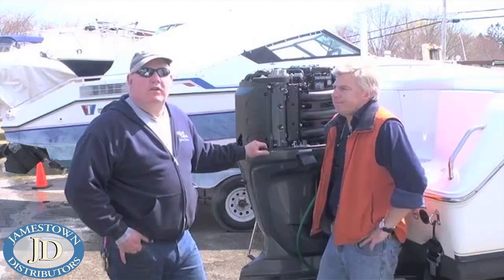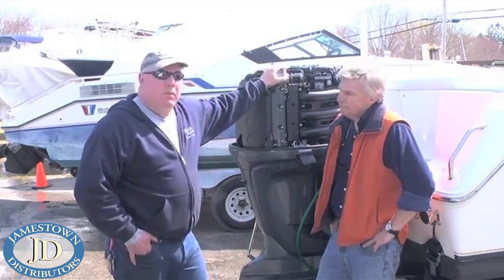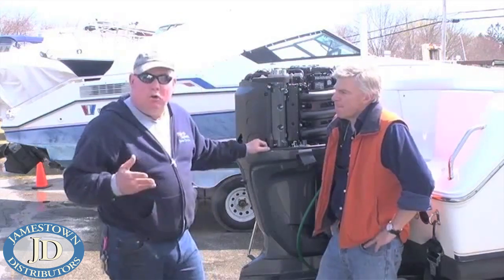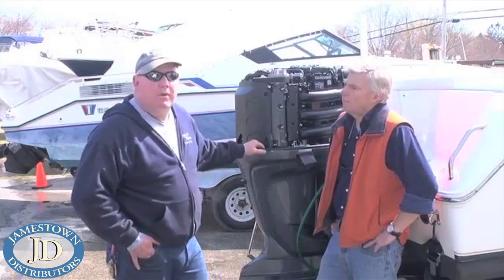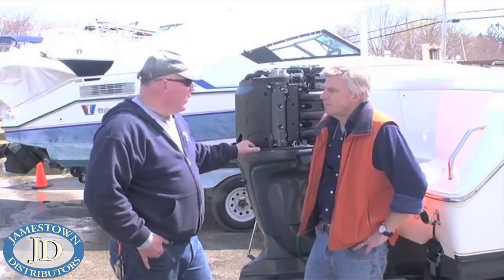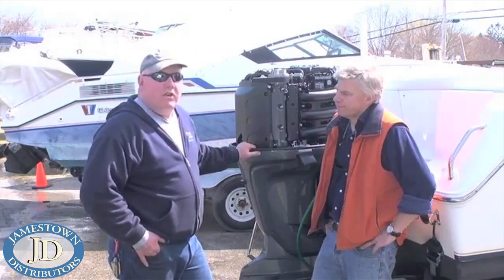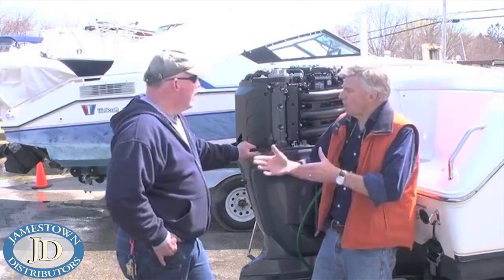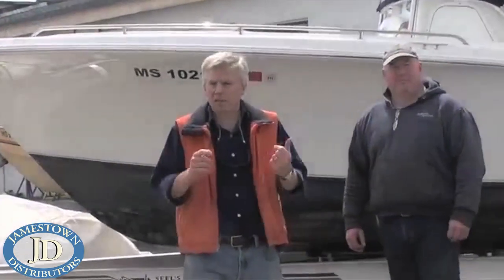Well, Tom, what we need to do is take a look at this engine — visually give it a once-over, making sure there are no issues with anything leaking, dripping, any kind of seepage or corrosion. At that point, the next step would be to check the charging system and the alternators, making sure that everything is tight and secure. A steering system check — we put it in and out of gear to make sure it's engaging and disengaging. And also the spark plugs — spark plugs will be the final thing that we do. I'm Tom Richardson for Boating Local. Check in with us in the coming weeks — we'll be back at North Atlantic Marine Services with Steve and his crew and they're going to walk us through more commissioning steps. Thanks for watching.